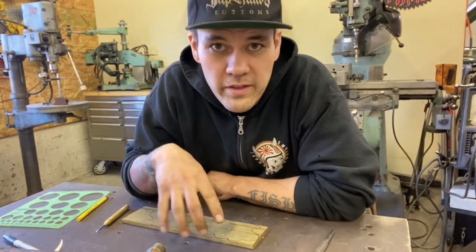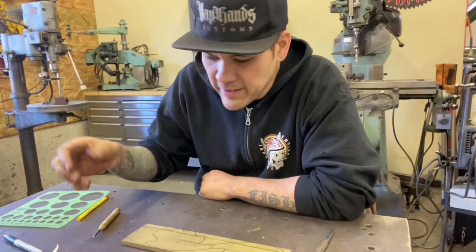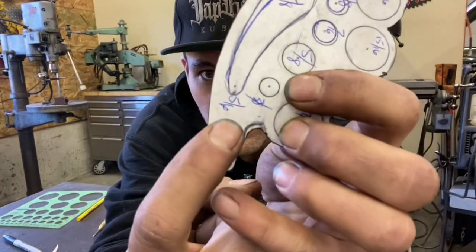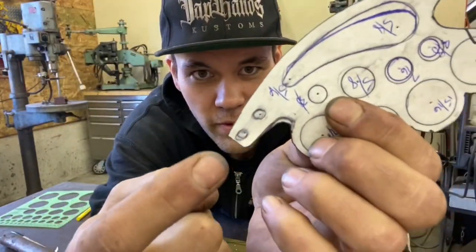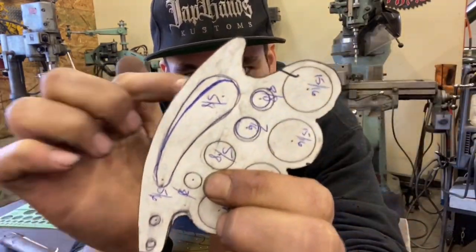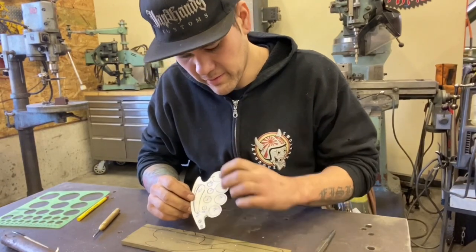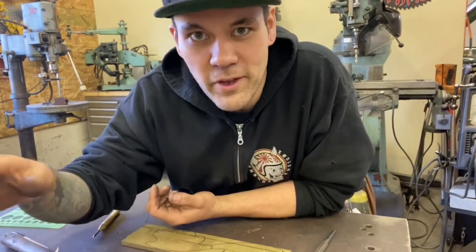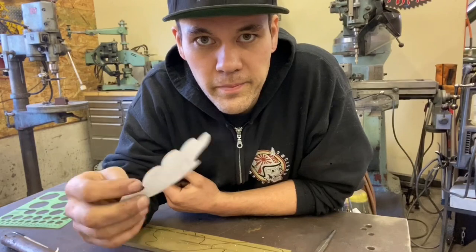What I like to do when drilling a lot of holes like this is drill with the smallest one first. Our smallest holes are the 5/16 holes. Actually, I'm going to pilot everything with a 1/8 drill bit. The two machine screw holes that attach to the adapter threaded for the shifter handle will be the smallest, so I'll pilot those with 1/8, then pilot everything with 1/8. Next is 5/16, then 3/8, then it jumps to 7/16, then 5/8, then 7/8, then 15/16. Least amount of drill bit changes, and stepping up is nice because the more meat you take off, the more possibility there is for chatter. That's why I like to step them up like that - it's efficient.